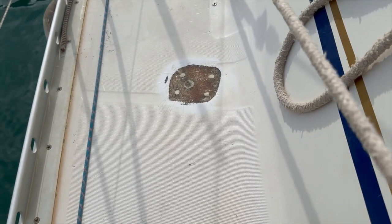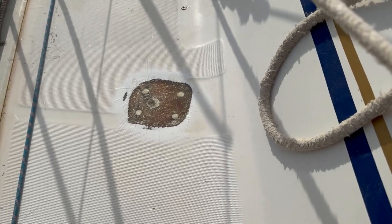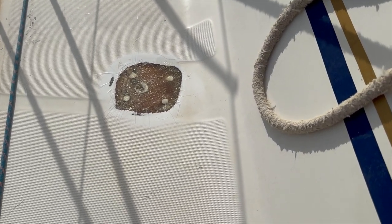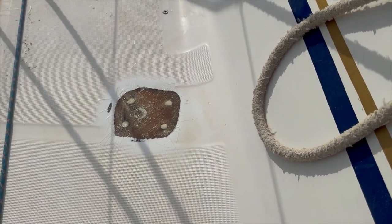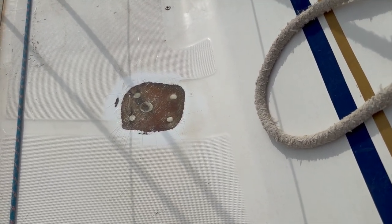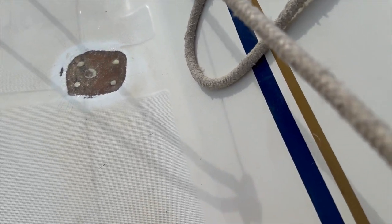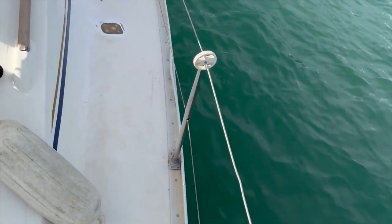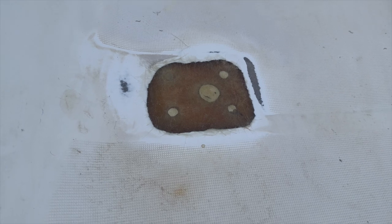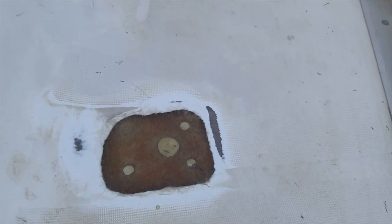In the torrential rain last night we had a number of leaks from these badly repaired chain plates. You can see where one chain plate has been moved further back as part of the racing rig. I've already laid two layers of fiberglass on there with the polyester resin, just waiting for that to cure. That should be enough to seal the leak, then tomorrow we can give it a quick sand and stick some gel coat on it. The other one is on the other side in the same place - exactly the same thing - so I've done the polyester resin and fiberglass and that's now ready.